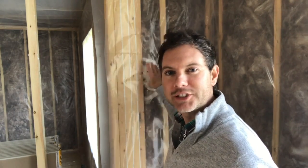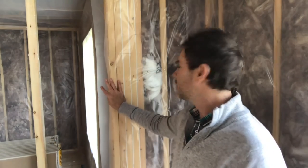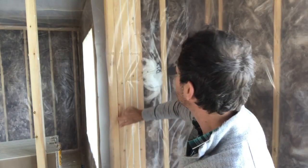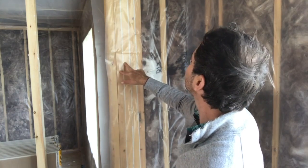The first thing I'm going to talk about is actually done before the vapor barrier goes up and before the actual insulation goes into the studs. You can see this white between the 2x4s here — this is an outside wall. Anytime you've got a couple of 2x4s that are directly abutting each other, you can't fit insulation there, but there's still the chance you can get a little pinhole of air coming through because a 2x4 isn't always completely straight. So anywhere we've got exterior walls, they're going to caulk that seam to eliminate any chance of air getting through.